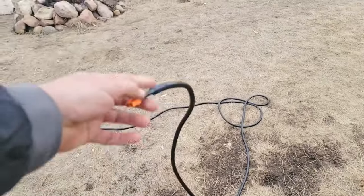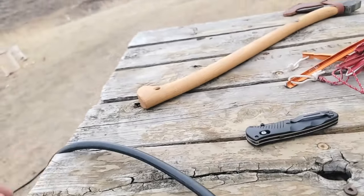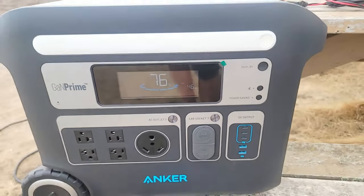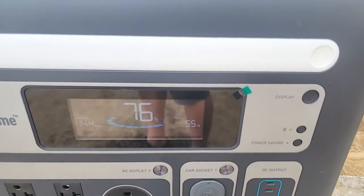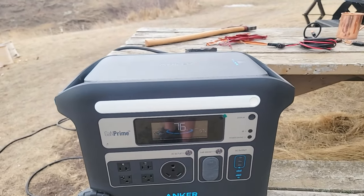Let's unplug ours. This is the cable for the PowerFilm — plug it back in just in case it was an anomaly and the clouds were affecting things. Let's see if it's going to be the same or if the PowerFilm's still going to produce a bit less power. We've got 46 watts. We had 56, 57, 58 — okay, now we're about the same. It's going to be the cloud cover. We're literally almost the same, around 58 watts with the PowerFilm. The reason I unplugged and plugged both of them back in — a total of four times — was to show the difference.